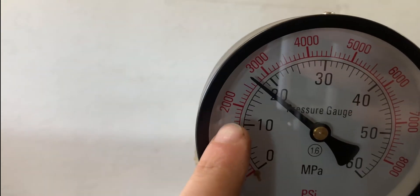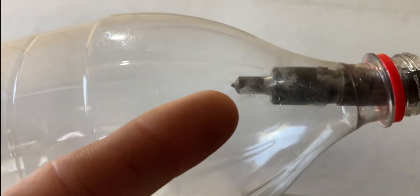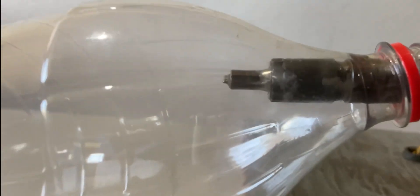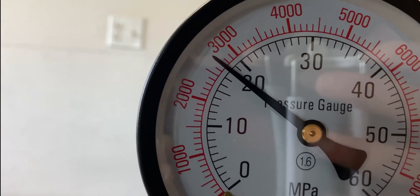The pressure right now is at 2700 PSI, and now when I go over to the diesel fuel injector you want to make sure that the tip of the valve body is perfectly dry. If you see a little drip underneath the valve body in this area, that means your diesel fuel injector is leaking. As you will see, this one is still perfectly dry and our pressure is still up at 2700 PSI.